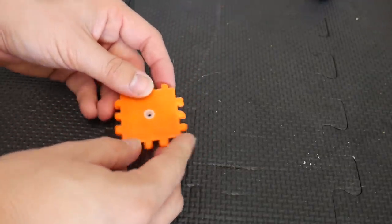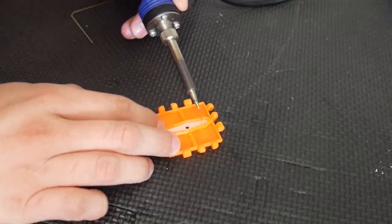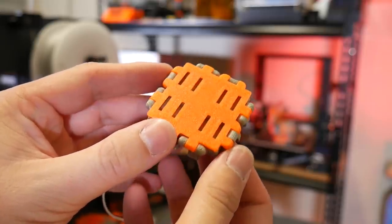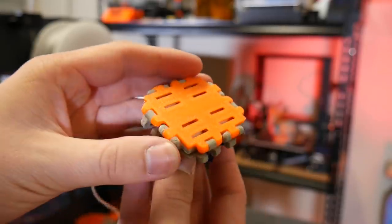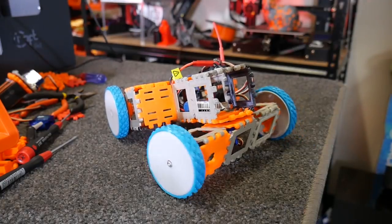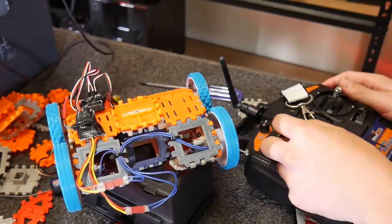The control horn mounting is actually a press-fit into a hole using the long two-arm control horn. You could use glue to hold it in place, but I found it quite easy to just get a soldering iron and wipe across the edges so it just melts the plastic into itself — and that is never coming off, ever. You shouldn't really do this with servos, by the way. So that gives you a rotational mount for a turret or some sort of wheel assembly, a great starting point for something that has to rotate precisely, versus the gear motors which rotate continuously.